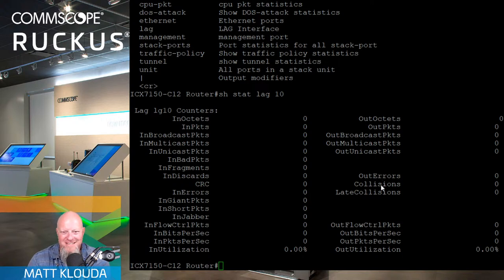I don't know if you know what port. You don't necessarily need to know what port. We can run this. You can run it on all of them. There's certain things that we're looking for. But knowing which port it's plugged into would be helpful. So hopefully the only things you have plugged into it would be your cable modem, which you can trace that cable easy. Your access point, that has power to it. We can find that one easy. And then the one that doesn't have power or probably doesn't even have link is the one where the doorbell's plugged into it. We'll find that one as well. It can power that doorbell. That doorbell's power draw is tiny, so there's not much to it.